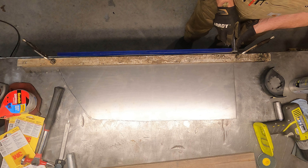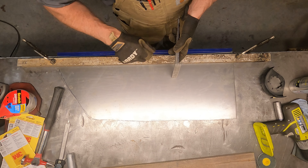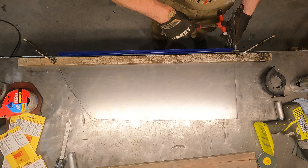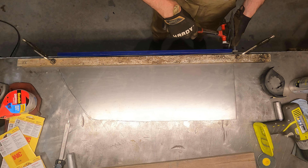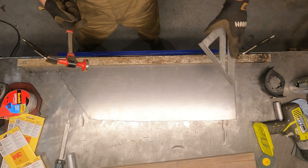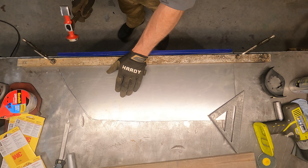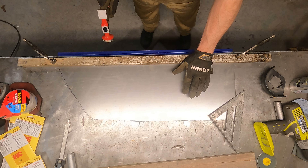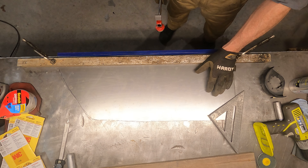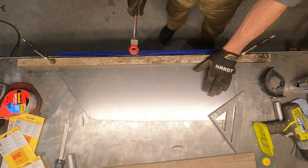This is going up against the edge of the table. I'm going to line this up with the scribe line and just tap it in until we're in the right spot. That one's dead on — did pretty good with that. Then we're just going to come through, little by little, and roll this edge over. You don't want to go too fast because if you do too big of a whack it wrinkles the metal — you stretch it in between hammer marks and put a wrinkle in it. So we want to go slow, just to roll this edge.